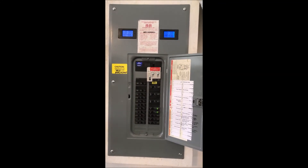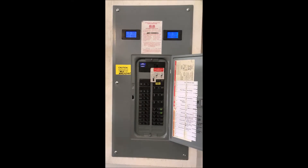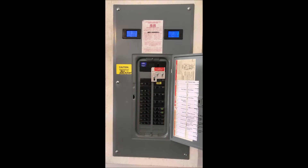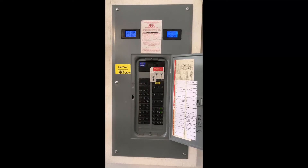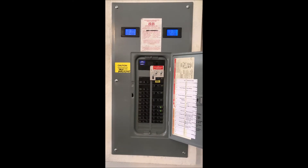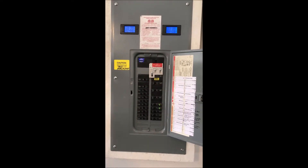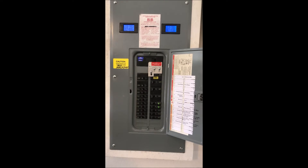Keep in mind, this is only 50 amp service as opposed to the 150 amp service we get from the power company. 50 amp service only allowed us to really run one major load at one time, like a water heater, which is about 5,500 watts, or you can run the clothes dryer or the stove.